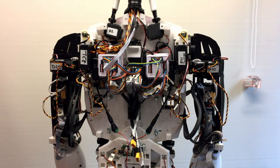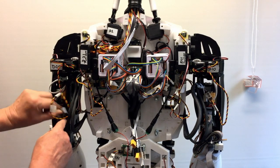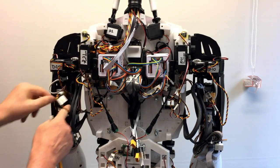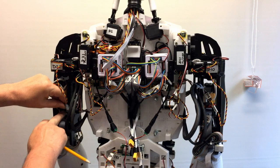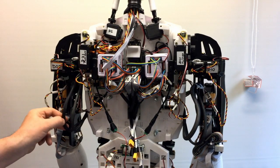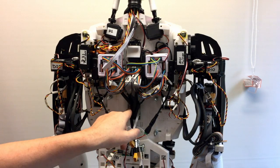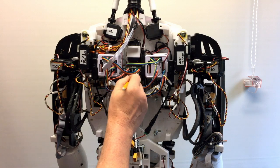I've got to get power to the hand, and I've wired it as originally done. The servos plug into one of Gail's little breakout boards which I've left in the forearm, which comes up and plugs into this cable coming out of the arm here. It's a through connector, so it's plugging into this board here, and at that point it's picking up power. This ribbon, which goes off in this black tubing inside and comes out here, doesn't contain power. These ribbons have just got signal and ground.